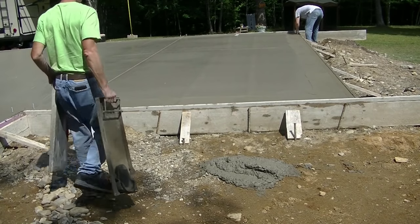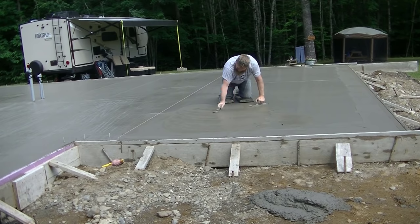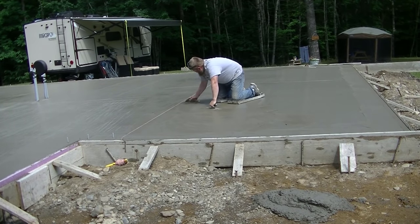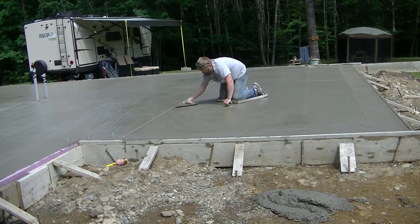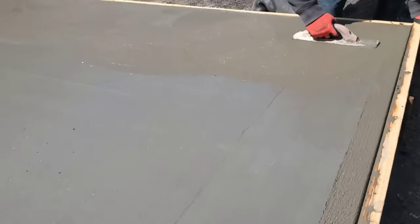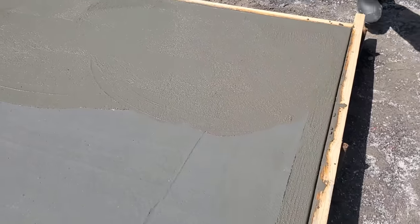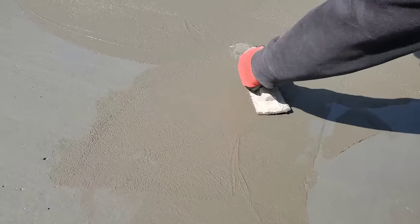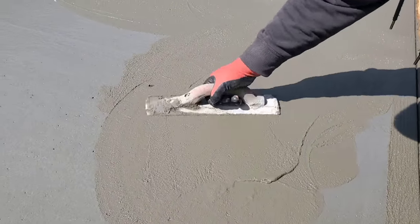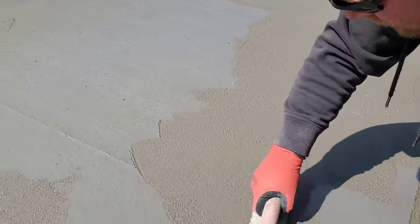When you're learning how to finish concrete, timing is really everything and there are a lot of variables. The concrete needs to be a certain firmness. When I could only press down maybe a quarter to three-eighths of an inch, that's still going to be a little too early to start the finishing process. You want to be able to press in about an eighth of an inch - three-sixteenths - then you know you're getting real close.